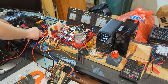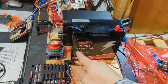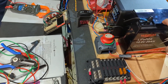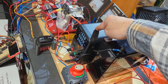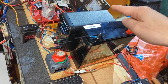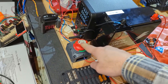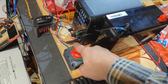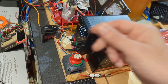We've got our new 12-volt battery — it's a lithium iron phosphate battery, and hopefully someone will tell us if this is not the right thing to do. This is our stand-in for the DC-to-DC converter right now, set to output 13.3 volts. This battery is right around 13.2 volts. With the switch off, neither is connected; on position two, just the battery is connected; on position one, just the DC-to-DC system is connected; and on one and two, it ties them both together to the output.